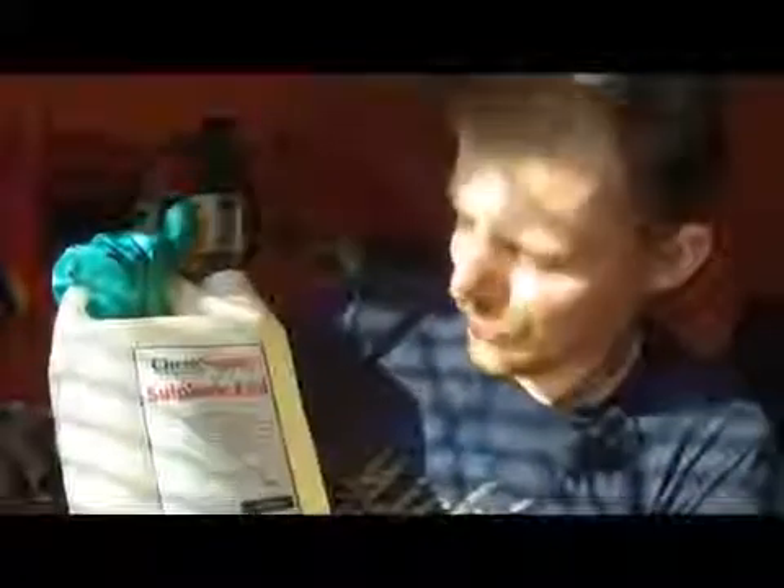You've got a gist of what you actually need to anodize. One thing I haven't mentioned is how you actually make the acid bath up. This is sulfuric acid and distilled water — those are the only two things; you've just got to get your mix right. It's not that easy to get hold of pure sulfuric acid — chemistry lab grade stuff. I was lucky; I found a place on the internet that sells it. A bit of googling and I'm sure you'll find it.